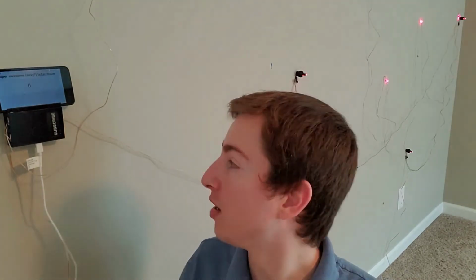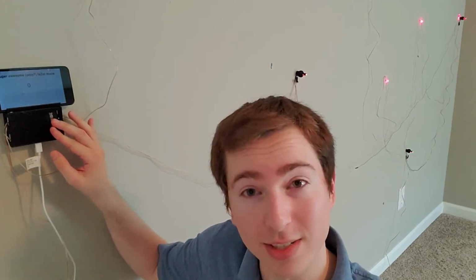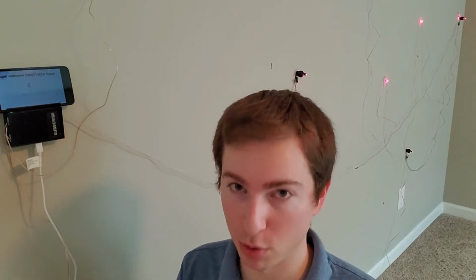So how this is done is when the lasers are on, you can go ahead and hold the subscribe button for 3 seconds, and then the lights will flash. And that will indicate that whatever light level or voltage level it's at when the lasers are shining at it, that's baseline. Anything above that means that the laser has been broken.